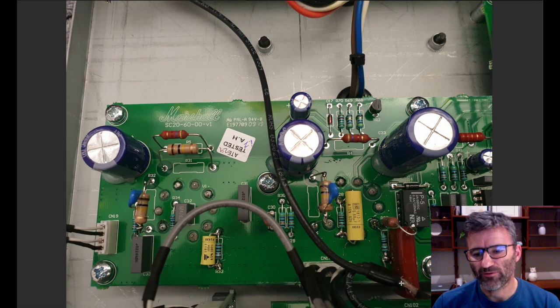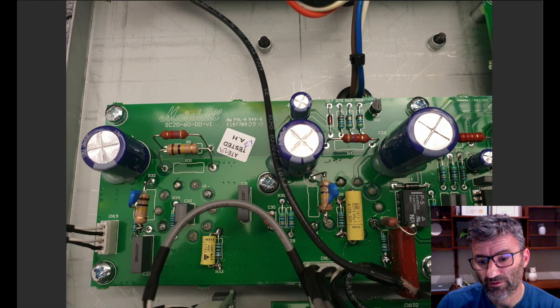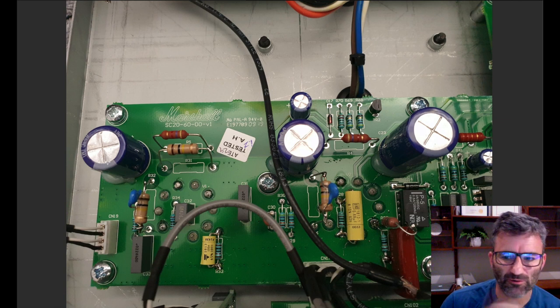Both of these are connected with a ground shield, and that ground shield connects to this end, really important, this end of this 100K resistor, which is audio ground. It's chassis ground for the amp. You need to ground that, two reasons. One is you get a ground shield on your coax, it obviously keeps the noise away, but the ground that you run on this coax here is actually used in the Zener clipping switch, so it's important.